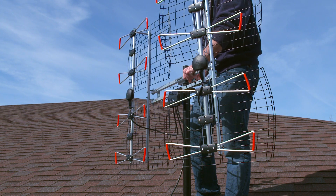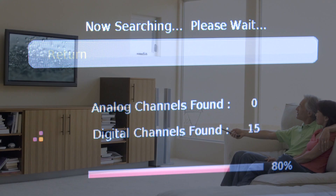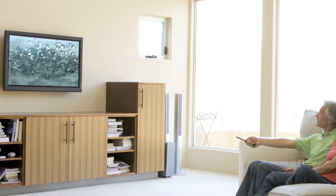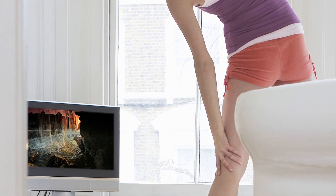Then, route the left and right coaxial cables through their respective panels, and attach the F connector on each panel, but do not over-tighten. Slide up the weather boot on each side. Use the small zip ties to affix the cables to their corresponding reflectors.